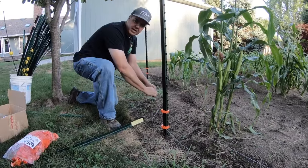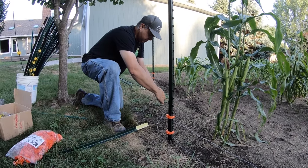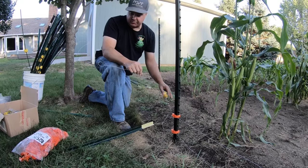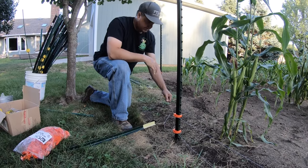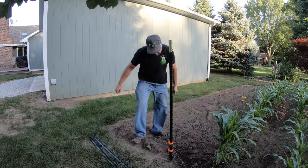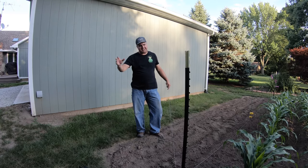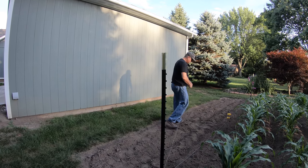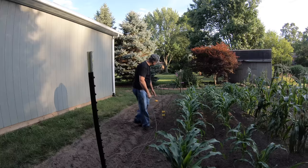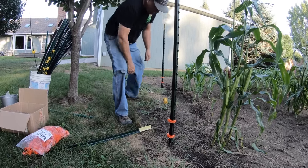If you have a way to use wire from year to year and store it so it unrolls easier the following year, leave a comment and let us know. There might be a better way to roll up the wire and store it year to year. But I think folks will be hard-pressed to find a better way to put these insulators on the T-post. It looks pretty tight. Sometimes we have to tighten it again during the season, but not very much. I just made a new loop, wrapped it around here several times. So it looks like if your wire isn't long enough from one year to the next, you can just add another piece of wire.